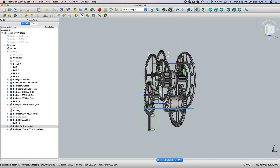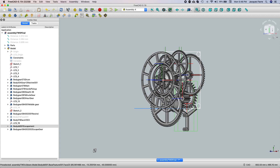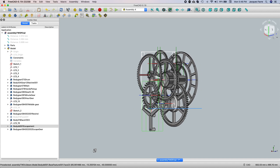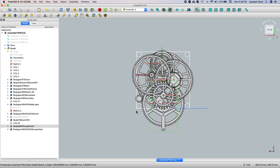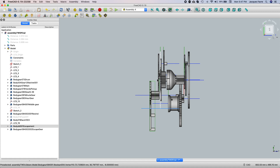The drum, the ratchet — I think now I can build. The outline for the frame is going to be this square — it's going to be 200 by 200 millimeters. It should fit on most printers. There will be one frame that will come here — the two main frames. One will come here and one will come here. And then there'll be a partial frame for the escapement that will be all the way back here.